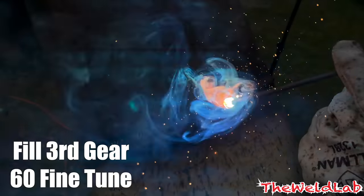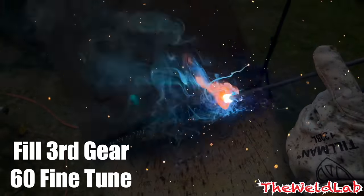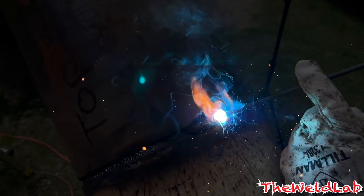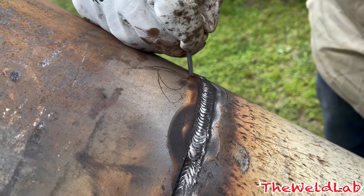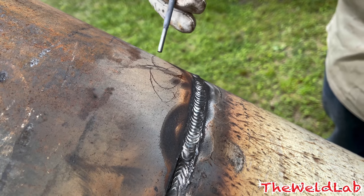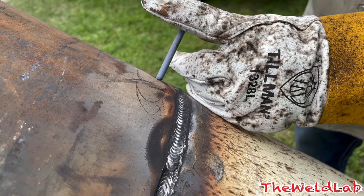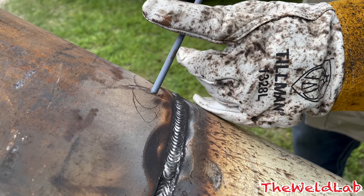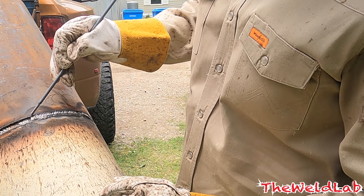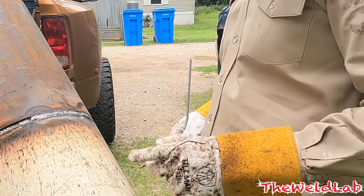Use a whipping J motion with again a slight angle, pushing up and making sure you're getting the top wall. On the bottom I'm doing this right here - using different temperatures. The colder I go, the longer the arc I have, because you can't have a cold puddle and run real close to it. Also remember on your filler, you want to grind it down clean - you don't want to leave any trash in there, especially on your start.